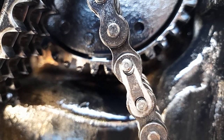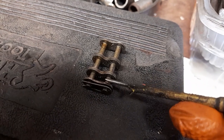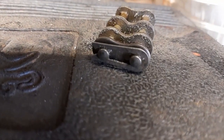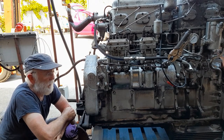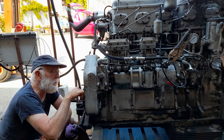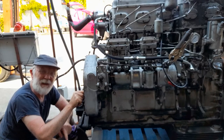Let me show you how those original old links worked. The Gardner is a triplex chain - we've got a third of the chain there, a third there, and a third there. Then we've got that clip on the outside. But that clip type has very much fallen out of fashion - they are really frowned upon now. The modern type has no clip; the pins are simply riveted in place. I've had quite a struggle getting the old link out, and I suspect somebody at some stage riveted the old link using the new riveting tool, which is why it stayed in place without the clip.